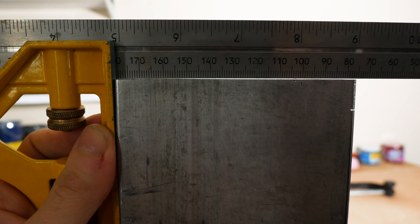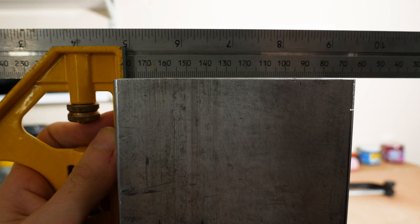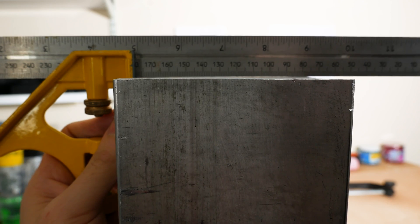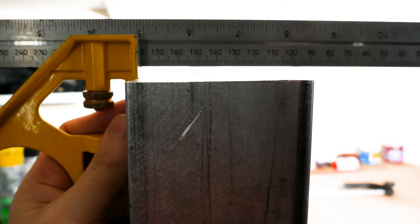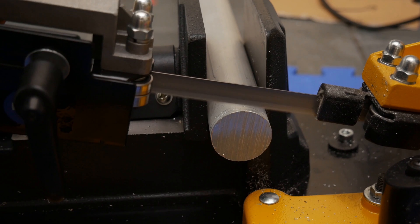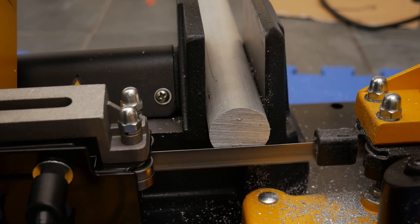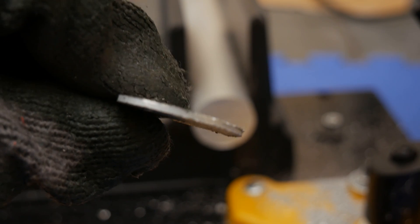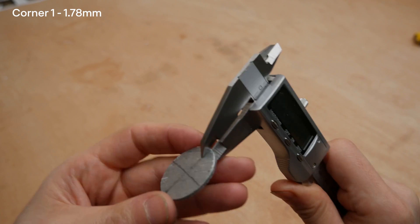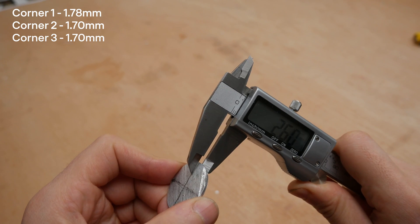Let's take a look at the squareness of the cut. Going across the cut things are pretty good — maybe off by one mil or less. Things are not as square if we look down the cut; you can see there is some lateral movement in the blade causing it to be thicker at the bottom of the cut. What I wanted to do next was see how thin a cut I could take — this is just some aluminium rail and I've taken a very thin slice of it. It cut really well; a very thin slice and looking at the four corners the tolerance appears to be within 0.1 of a mil, which is more than accurate enough for what I need.